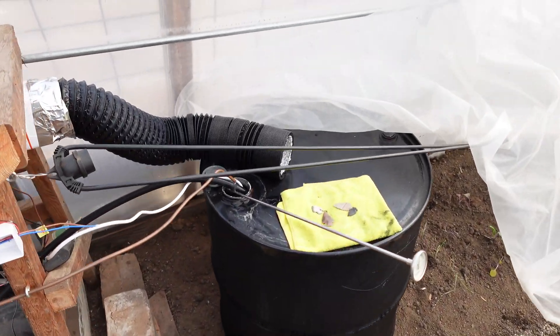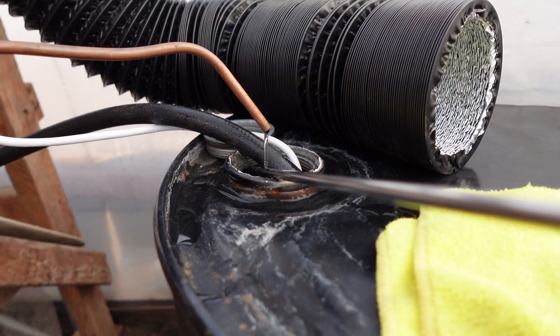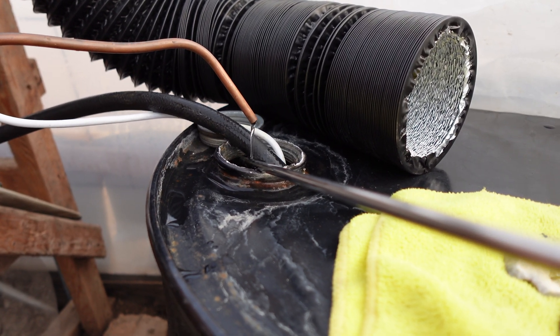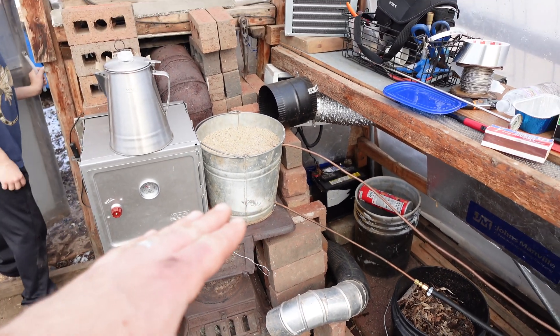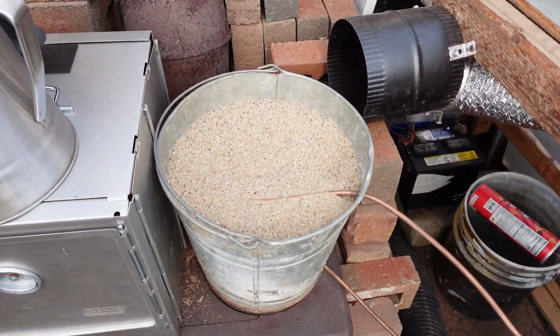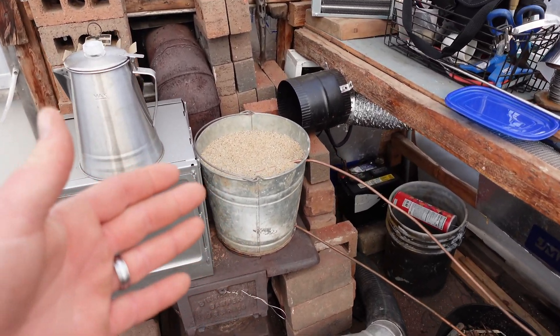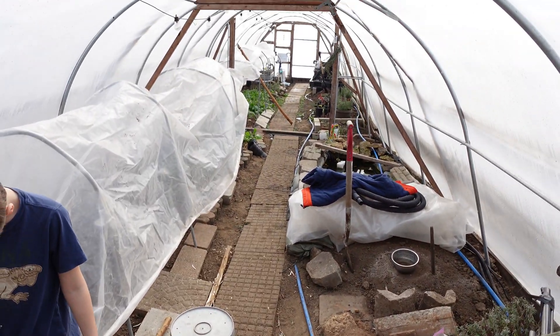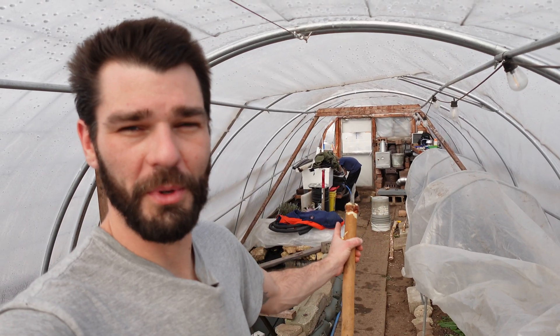We need to come out and film a long version video where we take temps from beginning, middle, and then basically at the end of the night where we run it for a couple hours before a cold night. This pipe physically feels hot — the sand holds a ton of thermal mass in there. Once you heat it up, it holds a lot of energy. It doesn't change form like water does and go to steam, so we can hold more energy in it — it just doesn't hold it as long as water would. Using sand combined with water thermal mass is using the two best thermal mass sources you possibly could. We're going to keep experimenting out here, and we will see you guys in the next video.